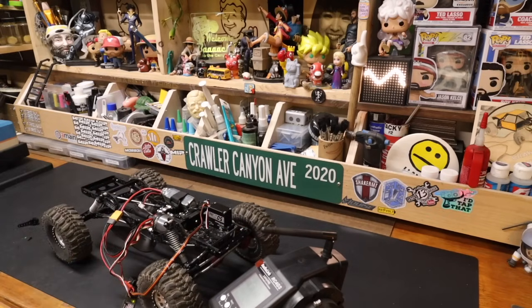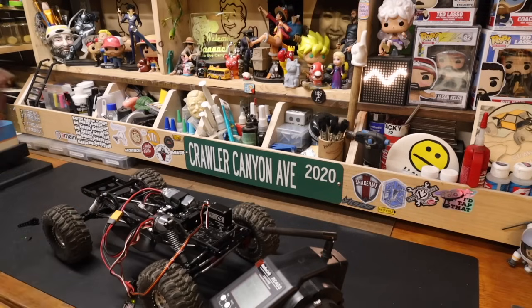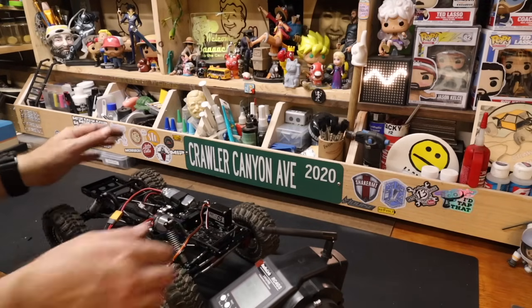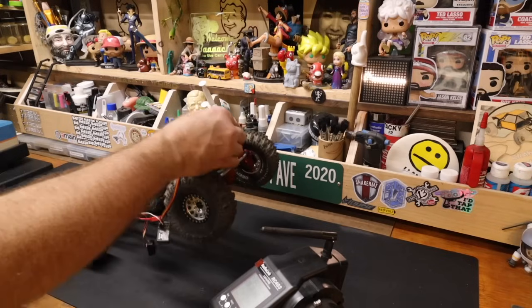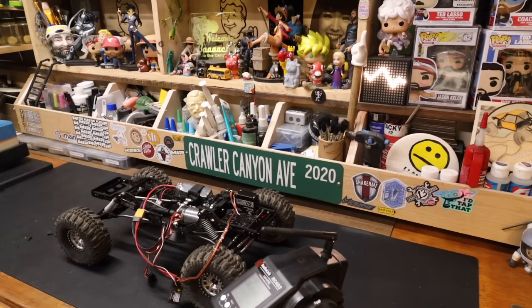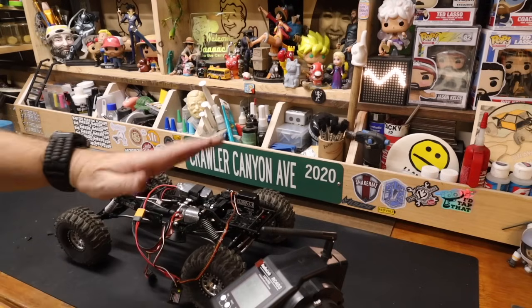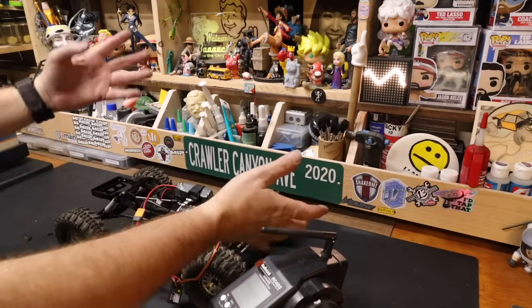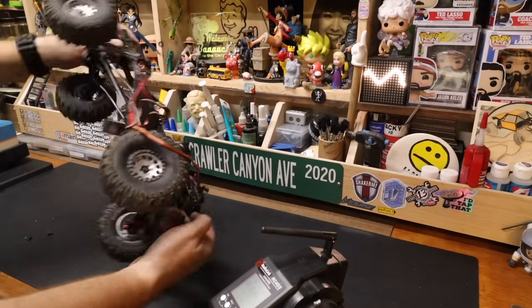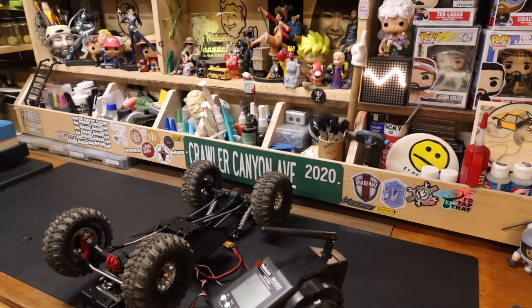Yeah, there we go. Hey, it's fixed. Still got a little bit of forward rake. Forward rake is absolutely fine because when you climb, the front's going to droop out and the rear's going to compress and you'll take out that rake. So that little bit of rake is going to help make these bite harder to breach over, theoretically. The variables will do what the variables do, which is absolutely run amok.